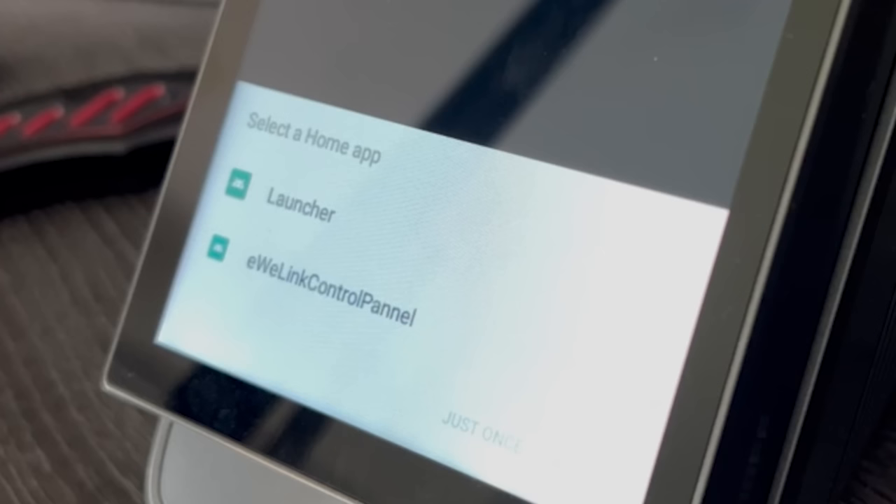The flow has two nodes. The top node controls the proximity sensor — you can edit the proximity values if needed. The bottom node handles screen adjustment, letting you set brightness to a specific value. If you select a node you'll see a pencil icon to edit it. Inside the proximity sensor node you can see the current sensor value, which changes based on how close something is. Take a step back and note the resting value, then set your distance threshold higher than that number so the screen turns on when you bring your hand close. Each panel may have different values — mine sit between 900 and 1000.